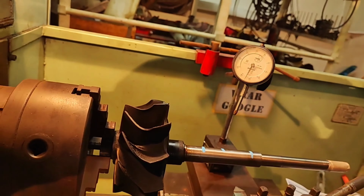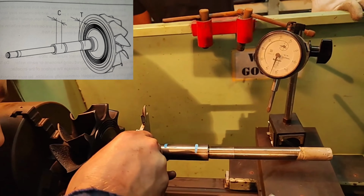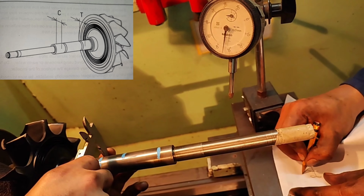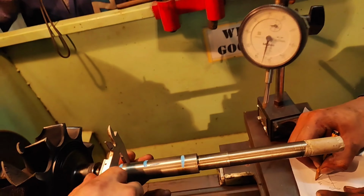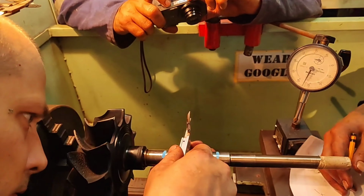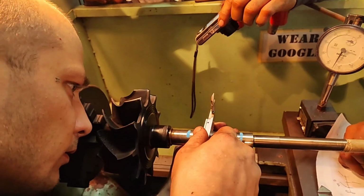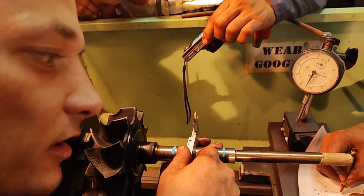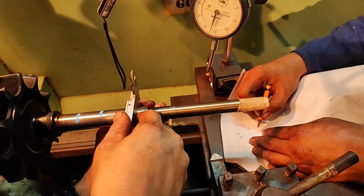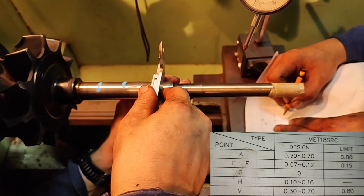The part of the rotor shaft that slides against the journal bearing is known as the journal part, and the shaft side is subject to wear. Close observation of the rotor shaft will reveal the sliding width relative to the journal bearing. Wear on the journal part on the shaft is determined by measuring the diameters of the journal bearing sliding parts and the areas outside C and T. Note that the diameter of the center part of the shaft is slightly less than the journal part at the time of manufacture. Compare the measured results with the clearance standard table.